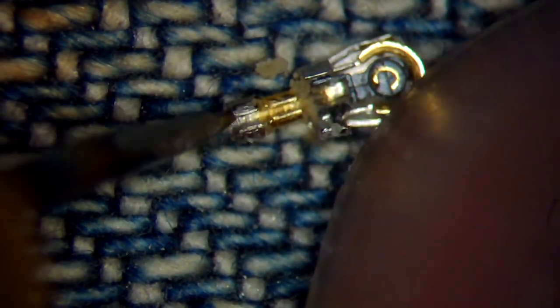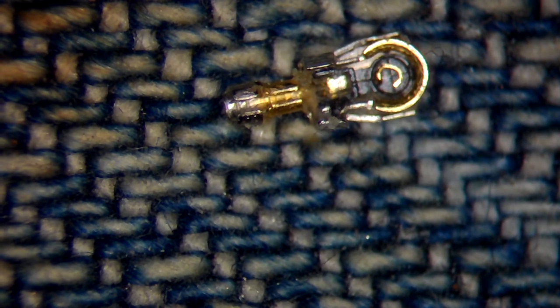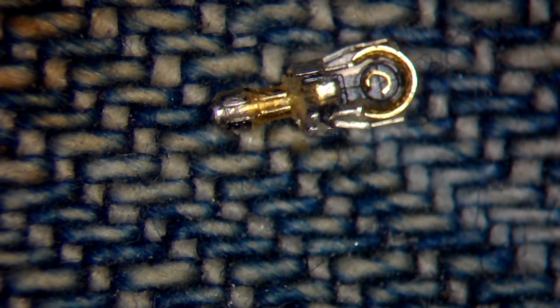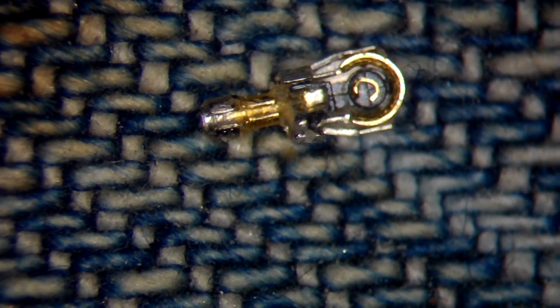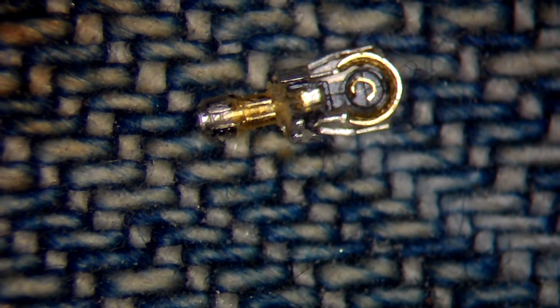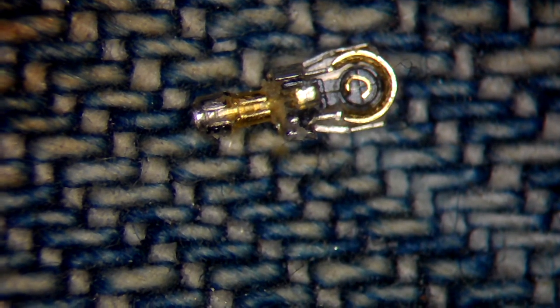Here it is. We have made room here. So what will we do now? To make this cable hold even better than before, I am going to solder it directly there. But with less temperature — give 250 — because the small connector will heat easy and fast. The same thing is for the cable. So, give 250.